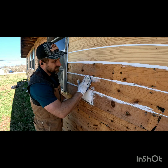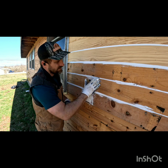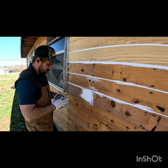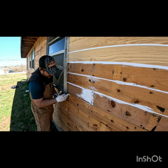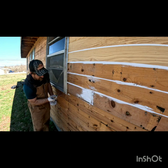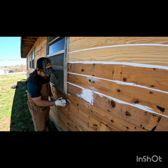When you're rubbing in the nails, it really doesn't matter if a little caulk gets on the board — it's going to stick just as good as paint does, so don't worry about a little extra. The main thing is keep moving. If you see a nail sticking out, that's why you want to keep your hammer close so you can get those nails flat.